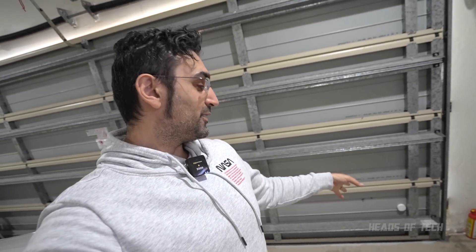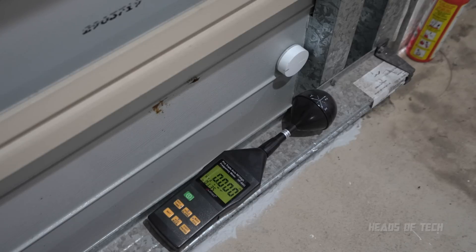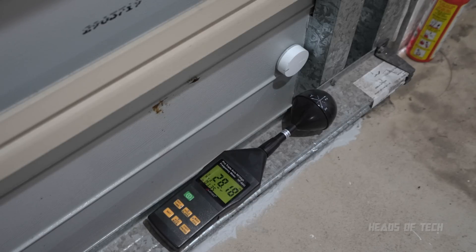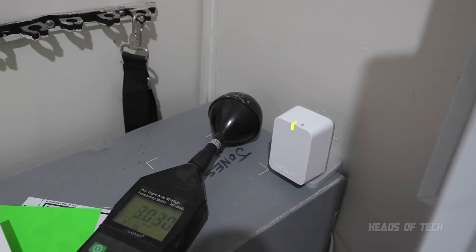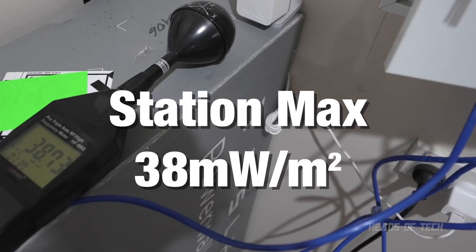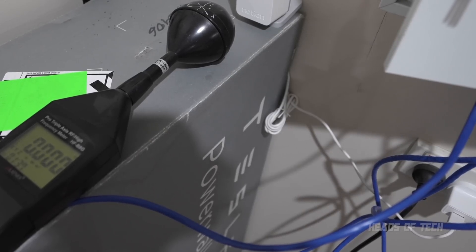Now I want to see how much RF these little transmitters are producing, and how much the base station is producing — just to give me an idea of whether I can store it near a baby or not, probably not. I left my RF meter running for quite a bit. It fluctuates every couple of seconds: you get some microwatts, and then every 30 seconds or so you get about two milliwatts. The receiver is also generally on the microwatts level, but maybe every 30 seconds it hits a milliwatt. I wouldn't put it next to anything fragile.